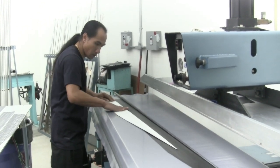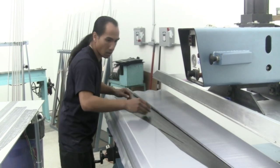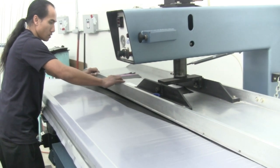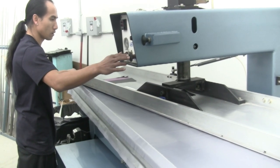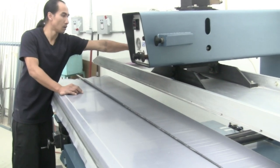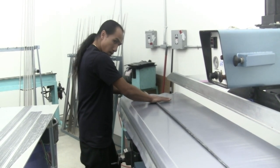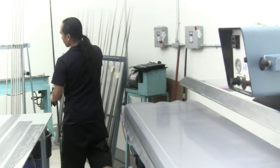This is one of our many rolling tables here at the Cousins factory. They're inlaying the next patterns into the blank there. You can put on air pull-tape to add some extra strength at the bottom of the blank so that when we pull the blank off once it's done cooking, it won't shatter up the blank. It gives it a little strength at the butt, and that piece will be cut off at the end of the process when you build the fishing rod.